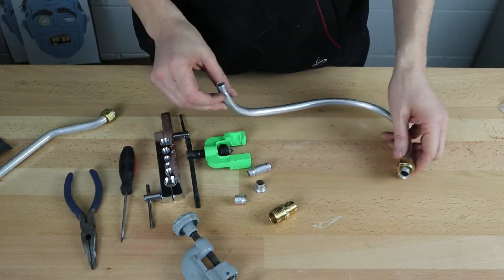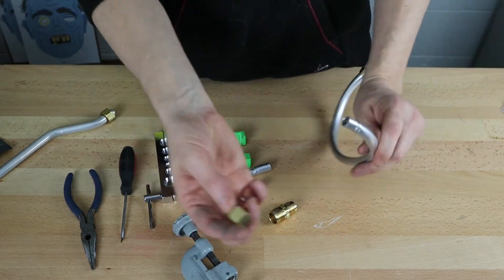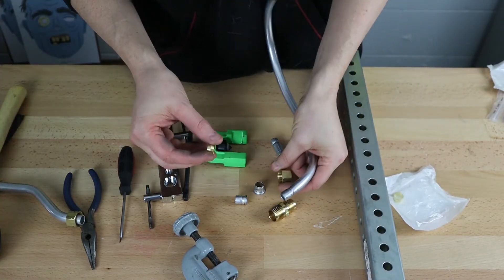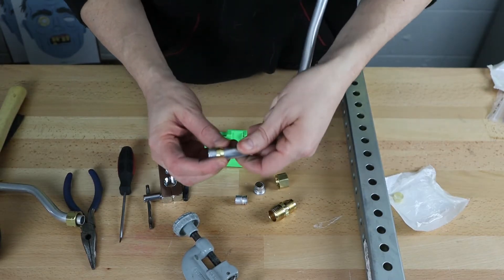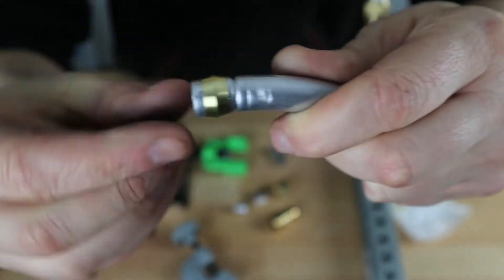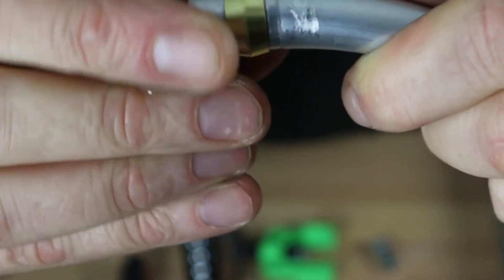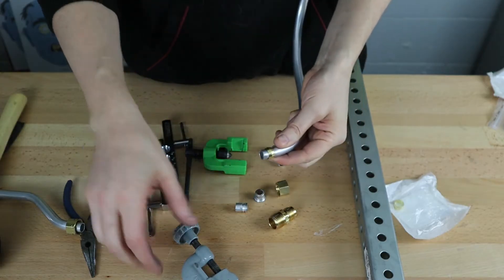The other side is going to be a little bit more tricky. I have my groove and I have my compression nut. Get your nut on there first — make sure it's in the right direction — and then take your compression sleeve. This little guy is going to be tricky, because if you botch this, thankfully you bought enough tubing that you can do it again. So what you're going to do is put your sleeve just barely over the edge of that groove — right there — just barely over the edge. Now it is covering it and goes just a little bit past. A piece of tape really helps to secure it down there.